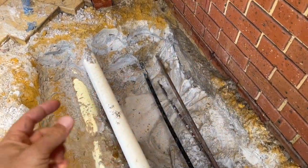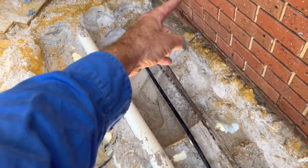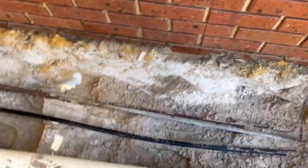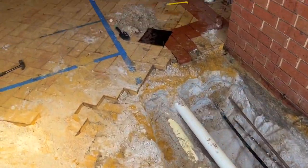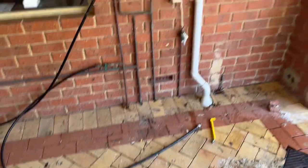Once the core drill is done, we can put all our pipes in and hook everything back up - hook the new shower line and existing floor waste gully up, then the new toilet line, and then start putting the pavers back up. But next thing we'll do here is pull up some pavers where the gas and everything is to see what's going on under there and figure out what that black main is.